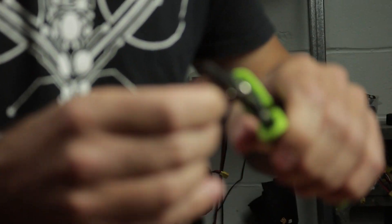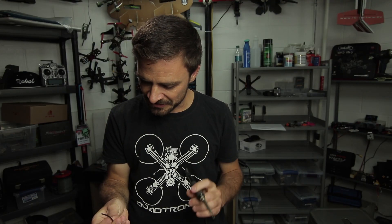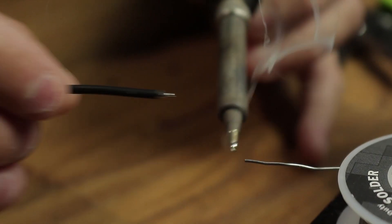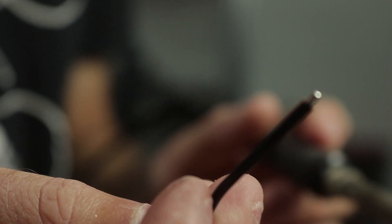That wire's done — let's get onto the 18 gauge wire. You don't even need the helping hands; you can just have the wire out and twist it around. All the solder has been soaked up into the end of that wire — it's all properly tinned and ready to go. A common mistake is people will only tin one side. I was actually spinning it in my hands to get the whole way around, because it's very easy to only tin one side and not get the solder fully penetrated, which makes it harder to solder later on.